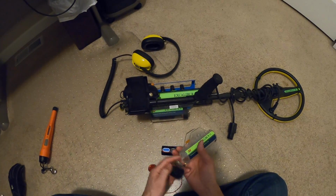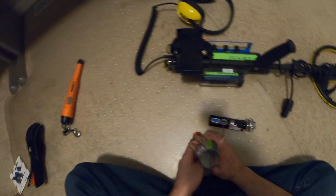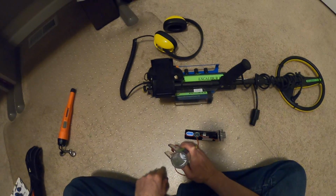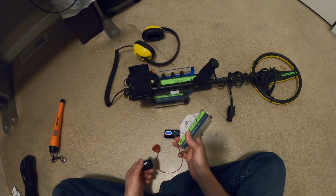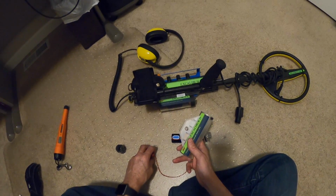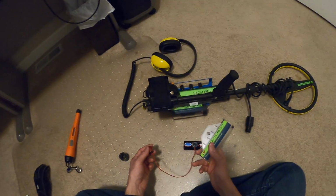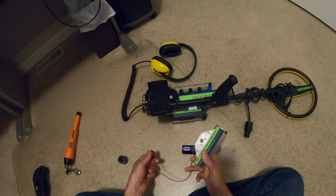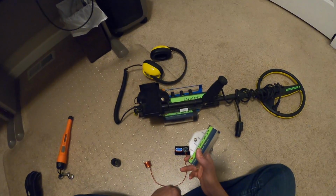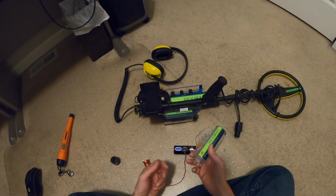And then I'll put a small hole here, put that whole switch assembly in there, and with the hole and a syringe I will inject the proper type of two-part epoxy. There's a very specific type that is used for marine use. If I use Delrin plastic, most epoxies will not adhere to that, but I've already found and sourced a product that will actually work, which is amazing. Delrin and some of the other plastics are self-lubricating, that's why it's so good for machining, but that also means some of the adhesives will not adhere to it.